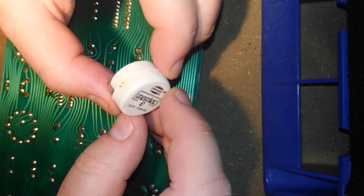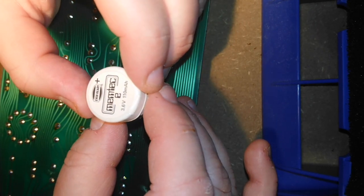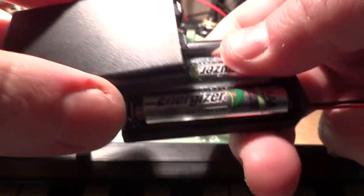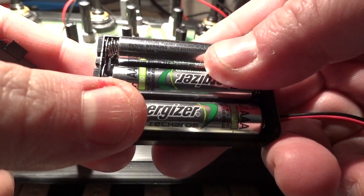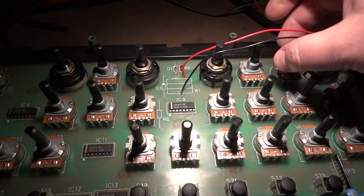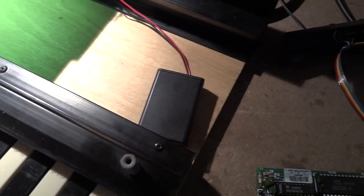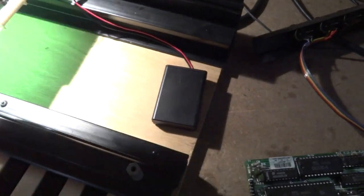Now we need to replace the battery. We could search the internet for a battery that fits perfectly in the available holes, or we could do what Synchaser did in his Oscar repair video. He replaced the Oscar nickel metal hydride battery with standard store rechargeable batteries, which are also nickel metal hydride. I'm using triple-A because I happen to have a triple-A holder for three batteries at home, but you might use double-A to get even longer battery life. I'll also use a lead and a connector to position the battery holder to the far right of the synthesizer, and I'll use velcro tape to attach it.